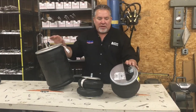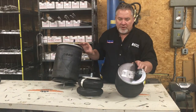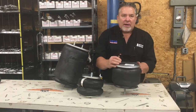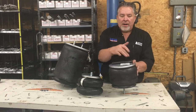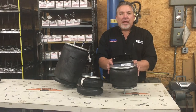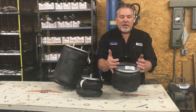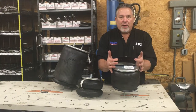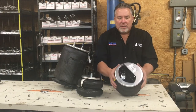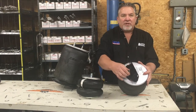One other thing you're going to want to look for — we'll go to the truck first for this particular one. This comes with its own mounting bracket; this would mount to the frame right here. If you have an airbag that's mounted to the frame like this, a lot of the new airbags do come with a new mounting bracket. It's nice to know your center-to-center measurement here to here. The mounting stud — air stud — has a big pipe that comes in and hooks into this for your air ride.